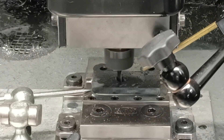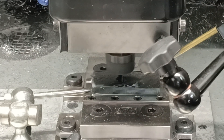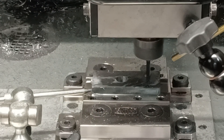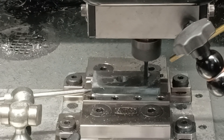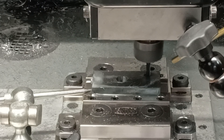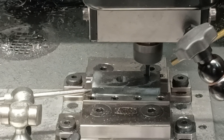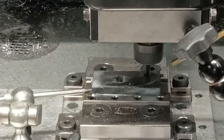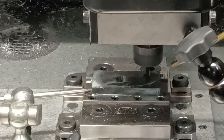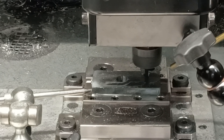The downside is that leaves me using smaller end mills than most people would. That was a 5-thou hole depth-of-cut path. The reason being is because I also have to do this little hole, and I don't like super tight helical tool paths — it shakes the machine and it's not good for the ball screws. This is a 5/16 hole with a 3/16 end mill. Could I use a quarter-inch end mill? I could, but that circular interpolation would be a really tight circle, and that doesn't allow room for the chips to evacuate the hole. So that's why I'm left with using a 3/16 end mill.